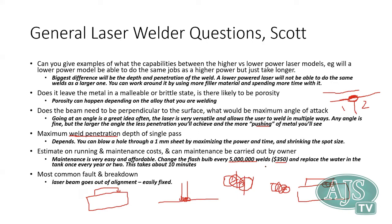You can drain and replace the water in the laser welder — it's deionized water and takes about 10 minutes, though some customers go years without doing it. For the pulse arc welder, consumables are argon gas and electrodes. One electrode gives approximately 5,000–6,000 welds and costs around $3–$4 to replace. Overall, running costs for either machine are quite low.